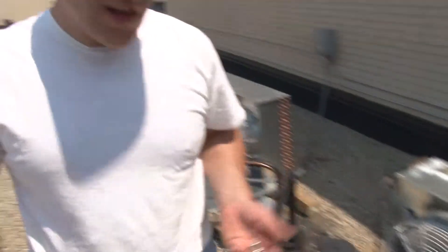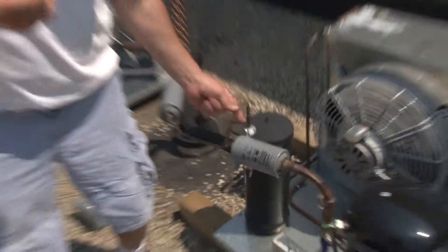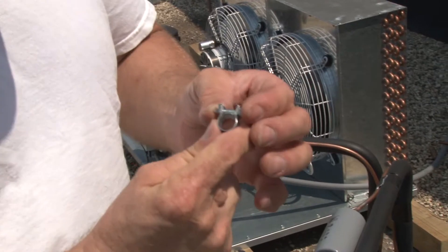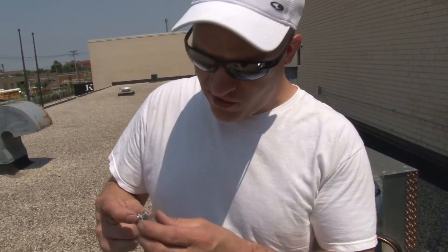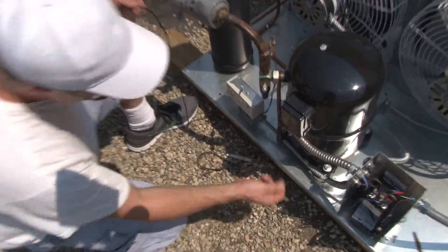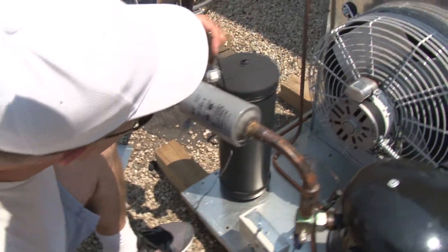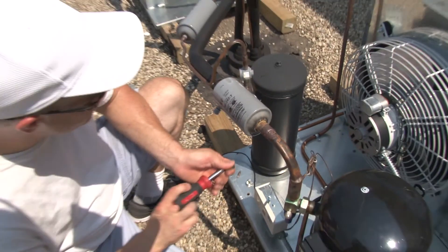What I use to mount the sensor — depending where you live, there's a hardware store or automotive store near you. You could use small hose clamps depending on the size of the line. This is a 3/8-inch line, so I've got a small half-inch hose clamp. I prefer these aeromotive-style clamps because they have a lot more contact area. But if you can't find those, you can use standard automotive hose clamps — you can find those anywhere at your auto parts store, Home Depot, anywhere.